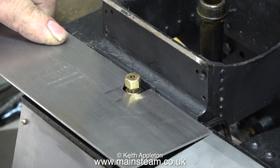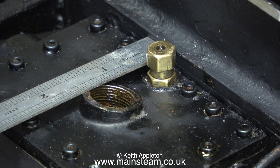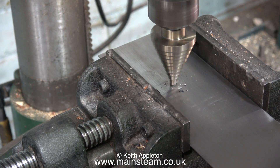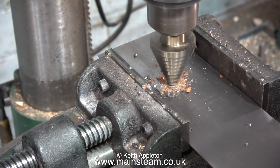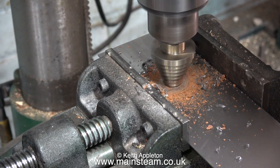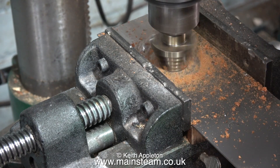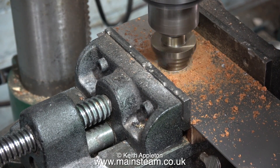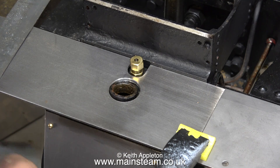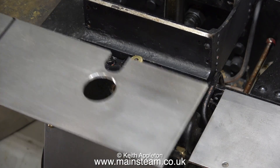Now it's time to make a large hole in the centre of this piece of steel to accommodate the main steam inlet pipe at this side. I'm arriving at the position of this specially shaped piece of casting by just measuring and comparing. These are stepped hole cutters — very useful things to have in the workshop. I'm going to use the largest one to drill a hole the correct diameter in the piece of steel, hopefully in the right place to accommodate the main steam pipe. It's better to use oil when doing this job, but for the purposes of the video I didn't bother, because underneath the steel plate is a piece of mahogany. This small piece of steel plate isn't very thick and the cutter is going through it very easily. When I put too much pressure on, the chuck stops, because the drilling machine belts are always left slack — this often saves snapping off small drills. Here's the finished product over the hole, and it's very good — near enough for rock and roll anyway. In this clip I'm marking the position where I need to cut the piece of steel, and once I cut this, it will be the same length as the piece of metal at the front of the smoke box.